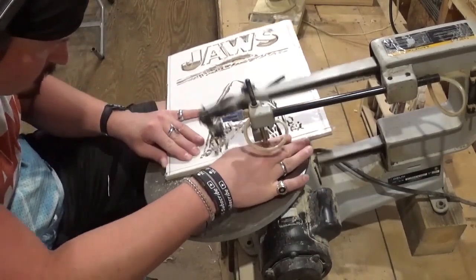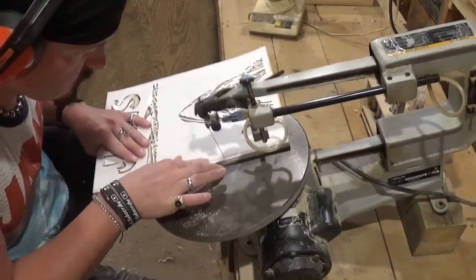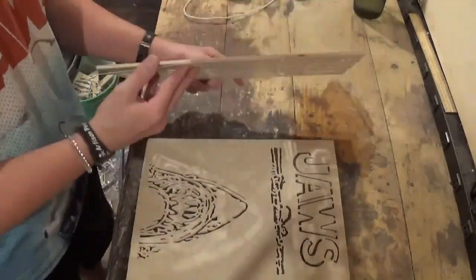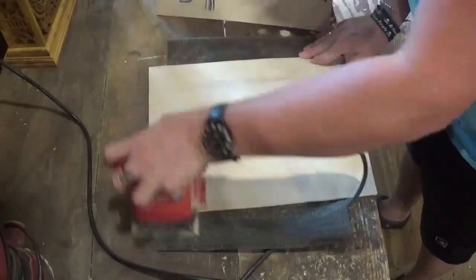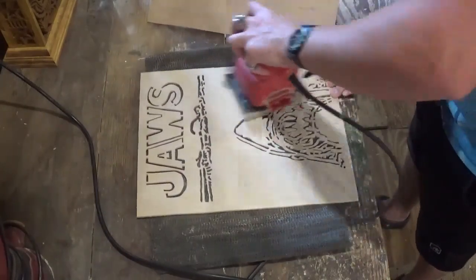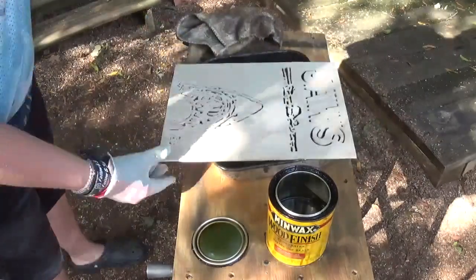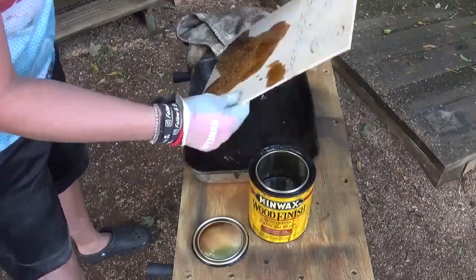Now releasing the piece from the wood by cutting it out to its final size — this piece almost maxed out my 16-inch Delta scroll saw. Removing the pattern, and there you can see the poster board stencil, so now we have a master of the pattern. We're going to head over to sanding and sand with 100-grit sandpaper on the palm sander, and I will do touch-up sanding with 220-grit sandpaper freehand off camera. Then we'll take the two pieces outside to stain and paint the backboard black with spray paint.